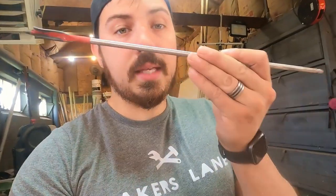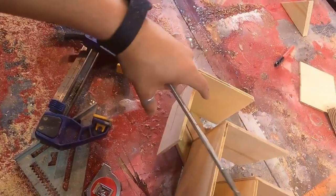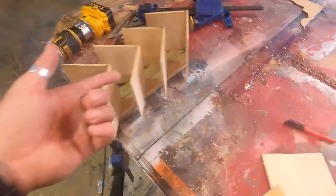I made a little bit of a mistake gluing those on already. I need to take this drill bit, it's a 1/2 inch drill bit, and take it up inside through here, basically all the way up to the top, to put the wires for the LEDs in. Now I have to do it post, which there's a good chance that I could end up screwing something up. Kind of nerve-wracking. I may have to start over and redo all of this. But if you're doing it, drill this hole ahead of time so that you don't have to worry about drilling it later.